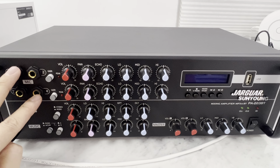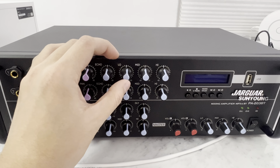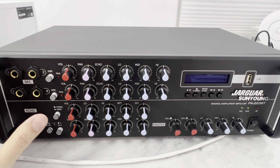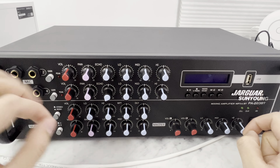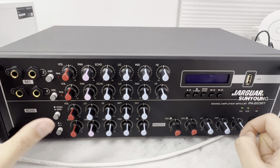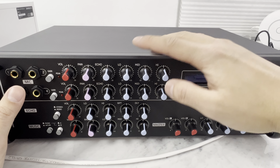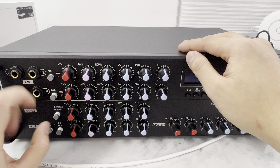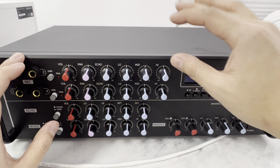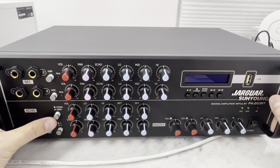It looks like there's a lot of knobs here but it's really not. The main ones — we have two sets of mics: four total. The top row controls the first two and the second row controls the second two. You can plug in two different brands of mics and tweak them to your liking — more echo on one, lower mids, lower highs, or even no echo on one and use it flat for speaking. My advice if you're a first-time user: just leave everything in the middle, then tweak one at a time. Low is bass, mid is mid-range, high is treble.